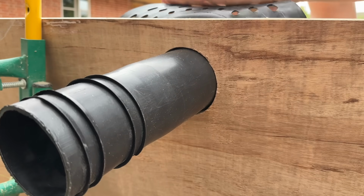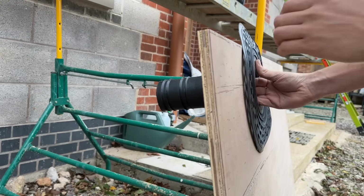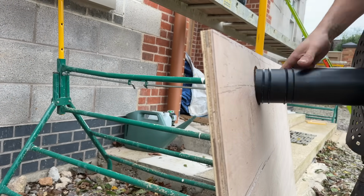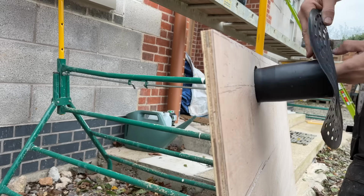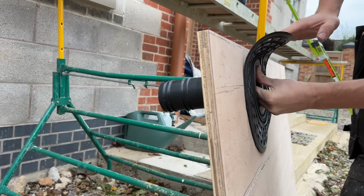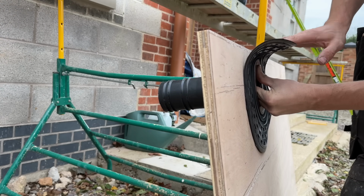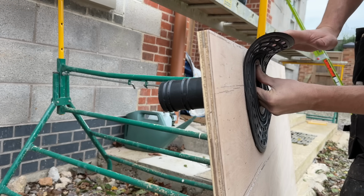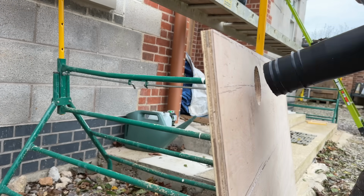And that bit's going to lip up the wall. Got to put in a little fillet in here to ramp the felt away from the wall, like a corner fillet. It doesn't want to be too big looking at that. Only probably wants to be 1 inch by 1 inch. Otherwise this bit's not going to be able to bend around it. There you go, let's get that in place.